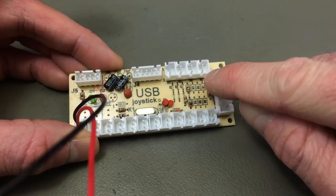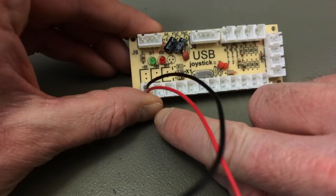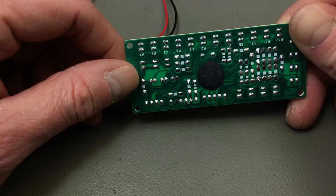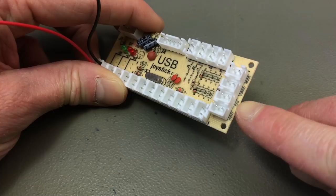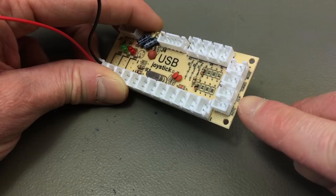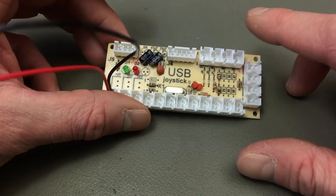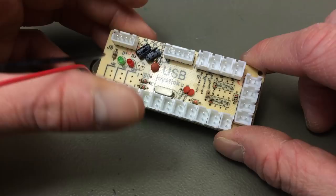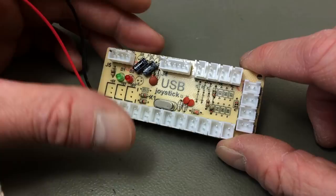On the board itself, the directions are conveniently labeled: AU, AD, AR, AL, which stand for up, down, right, left. The whole other row is fire buttons, labeled on the back — K1, K2, K3 are the ones we're going to hook up, since we only have three fire buttons. There are extra functions triggered by other buttons — I think there's an autofire function and different modes — but I'm not going to use those. I just want a simple basic adapter from old-style Atari joysticks to a modern USB interface.